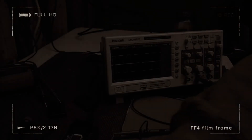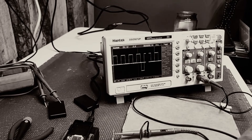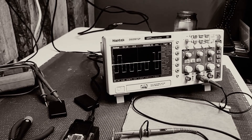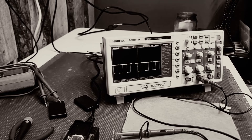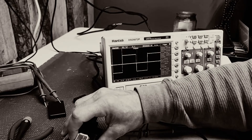If I take one coil out, we're just going to get half the wave. That's back in — we've got the bottom part. Take the top off, we've got the bottom part. So that's one coil doing one square wave and that's the other coil doing the other square wave — zero, one, two, three, four, five.